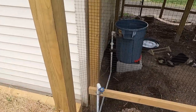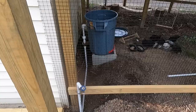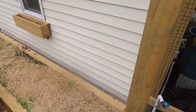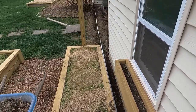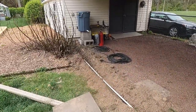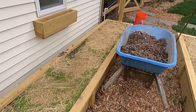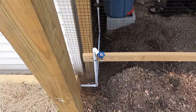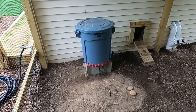Alright guys, all done. That's the way it looks — I still have to level it, tilt the blocks forward a little bit, but it looks pretty good. I like the valves, I like it all. Now is the moment of truth — time to fire the water up, get this thing going, and make sure we have no leaks down in the trench. One thing to note: when you put in new plumbing and a new system like this, you want to leave your valves open on the end of the line. I'm going to open all the valves in the yard because there could be air, and that air pushed by water can pop PVC fittings right off. So let's open all the valves and fire this bad boy on.